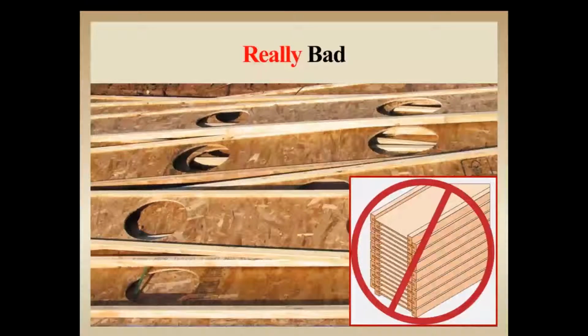But the minute they broke the I-joist open, you can see here that they dumped the material out in a very random, haphazard way. And now we've got some induced stress. We've got not only flatwise bending when they pick it up, but you can see we've also got these bows or twists that are starting to be imposed on the I-joist. That becomes a really big issue when we cut this large of a hole in the I-joist. We've got a much more sensitive area to actually snap or break the I-joist in half in a flatwise bending.